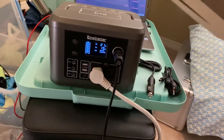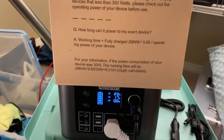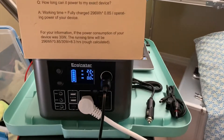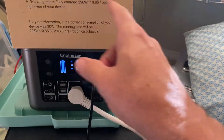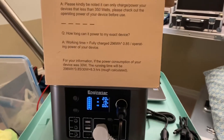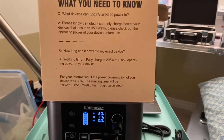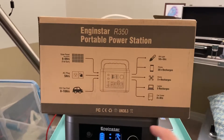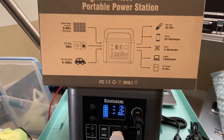Here's the box — it's the Engine Star R350 Portable Power Station. They even give you the formula for working time: fully charged it's 296 watt-hours, multiply by 0.85 (you lose about 15%), then divide by your device's operating wattage. For example, if you have something that pulls 30 watts, you can roughly get about 8 hours of battery. On this side it shows your charging methods: solar panel takes 6-8 hours in full sun, AC plug takes 5 hours, and 12-volt car connector takes 8-10 hours.